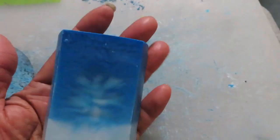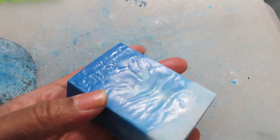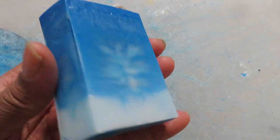We'll find the picture, put it on there, trace it, and then stick it in plaster of Paris. Once that hardens up, melt the wax out, recollect the wax. Then we have a mold in which we can make an exact duplicate of something that is really nice and sellable. Otherwise if we're just going to use it as scrap, we just pour metal in here just like this and leave it as that.